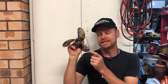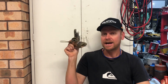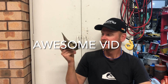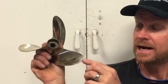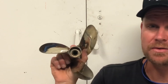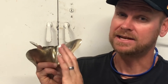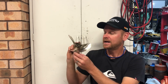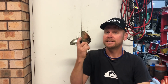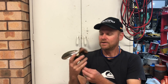I've gone ahead and cut the tips off the blades. I used a template, balanced it, and did a water test on this prop — I think it's about two videos ago on the channel, so go and check that out. I was really impressed — it actually got a really good top end speed. Jumping up on the plane was a little bit difficult though, so because I'm running this really high out of the water, I'm going to add a little bit of cupping to these trailing edges, just a tiny cup — I don't want to increase the pitch much. Also the trailing edge of these blades was really thick, so I'm just fairing that back in. I'm going to jump in, put a tiny cup on these, finish fairing the backs in, then balance it again. Next video will probably cover whether that made any positive changes.